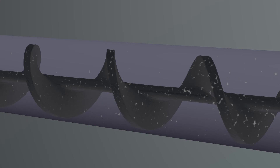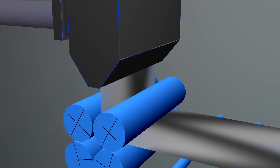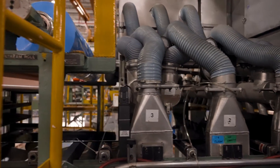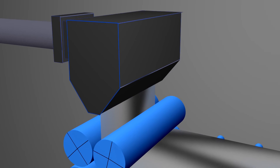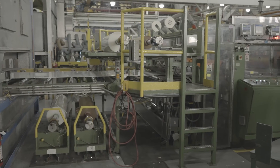The extruder melts and mixes the additives with the clear acrylic pellets, and then the molten acrylic is spread into a die — four foot, five foot, six foot, eight foot wide dies — which spread out the acrylic. That then goes through a series of rolls that set the thickness of the sheet and also the surface quality of the sheet.